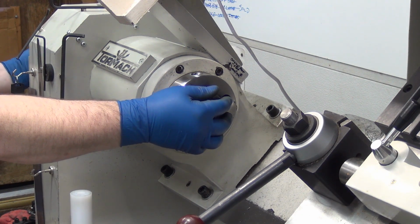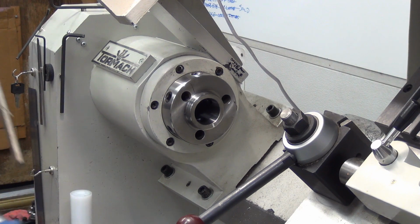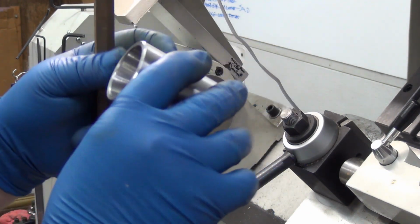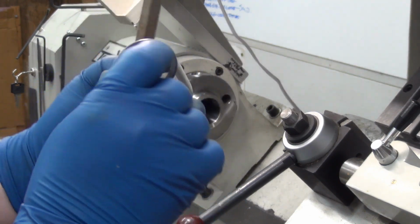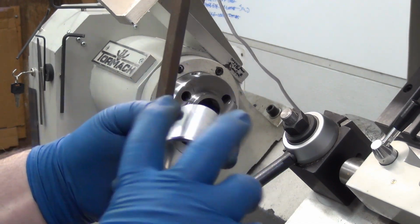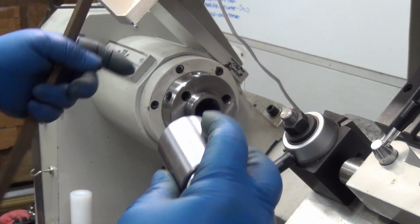So, there we go. That didn't take much at all, and I just used a piece of rod I had laying around here. That's basically what it looks like. I have another one that came with the machine that said it's slightly damaged. No clue what that means, but the pin is missing, and that pin is what the collet locks in on, so you slide it in, that way the collet doesn't spin. You tighten it up from the other end with the threaded tube that goes through.